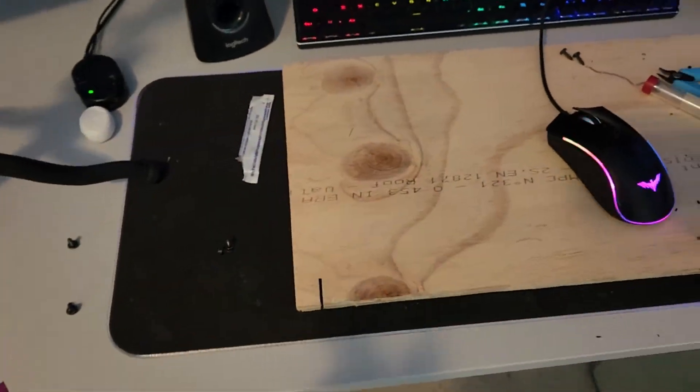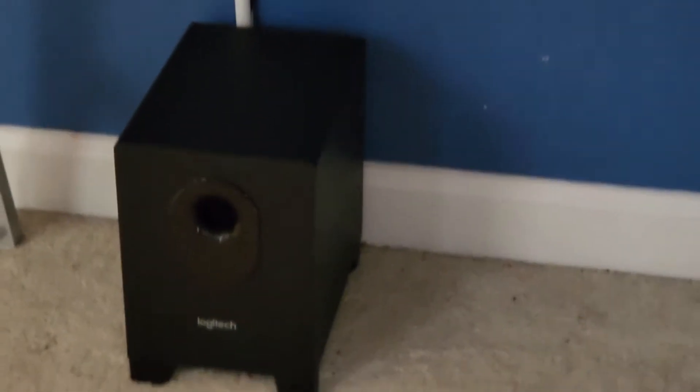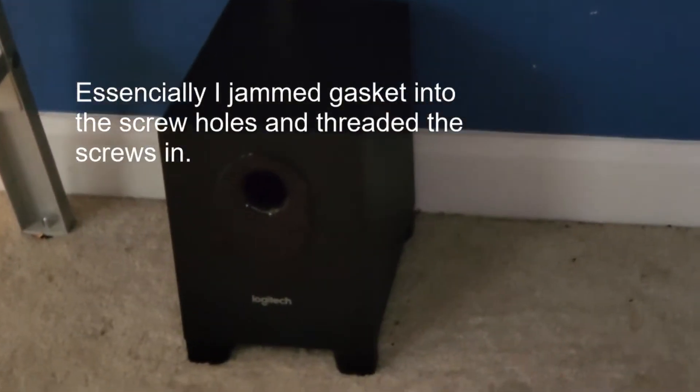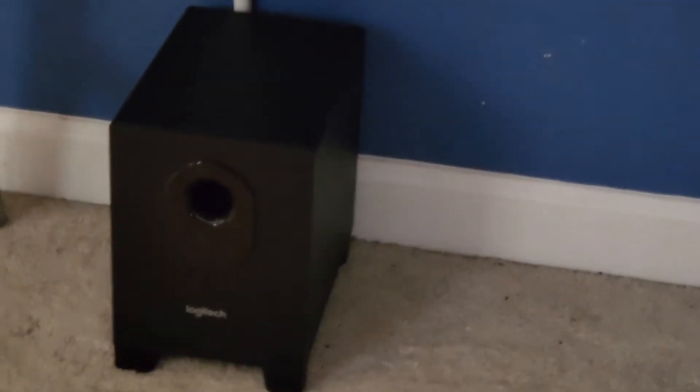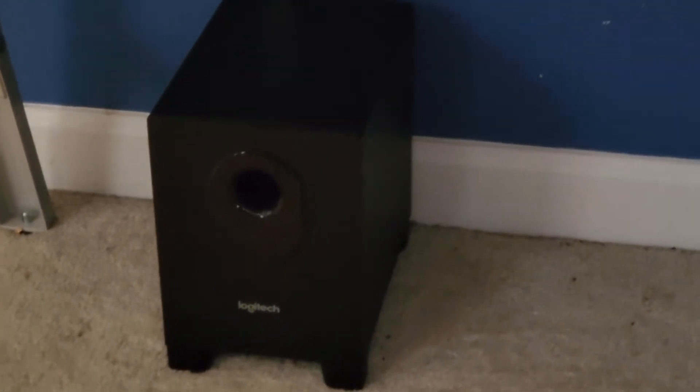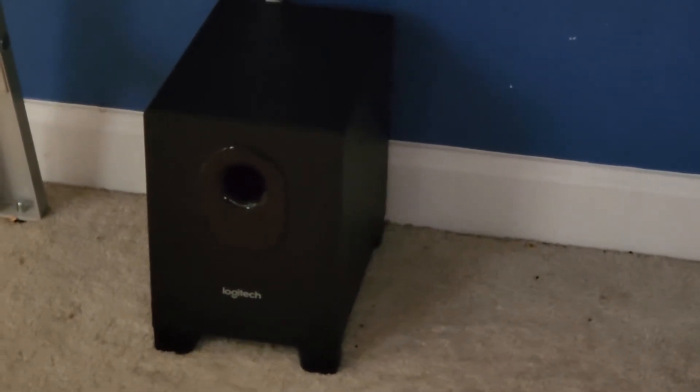It sounds good. I'm going to clean up the desk a little. So after a little bit of screwing around, the woofer seemed to be making a distorted buzzing noise. When I took it out of the cabinet, it stopped. So I put some gasket over the screw holes, screwed in the factory screws, and it seemed to have gone away. After that I heard something bouncing in there — I presume like metal debris or maybe solder — but after running some tones through it, it's completely gone. And all I get is port noise, which is normal for this cabinet. It's not really well tuned.